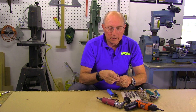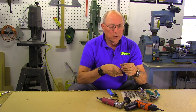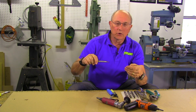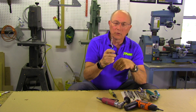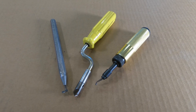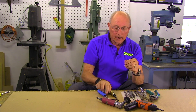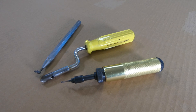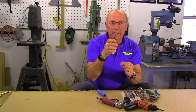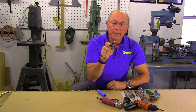The next thing you're going to think about is deburring — the process of taking all the burrs off the edge of a piece of metal or off holes you've drilled. This is an edge deburring tool which you draw along the edge of sheet metal and it catches both sides at the same time. This is a hole deburring tool — you put it in the hole and spin it once or twice and it takes that nice edge off, but you have to be careful because it's really easy to over-deburr and actually countersink the hole. You'll also find the Shaviv tool, which goes inside the hole and when you spin it you can deburr the inside as well as the outside — very handy if you have to get to the back side of a hole you can't reach.